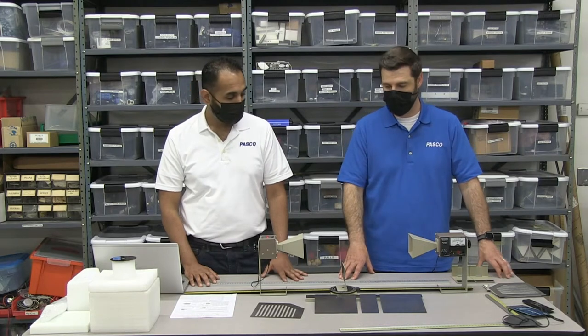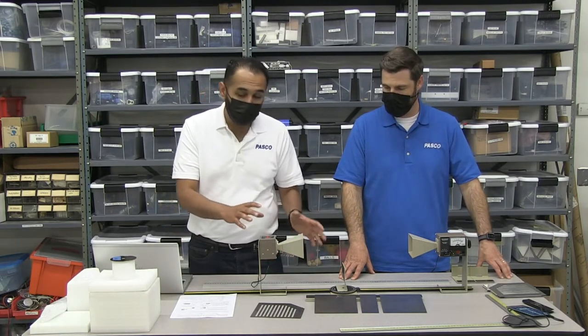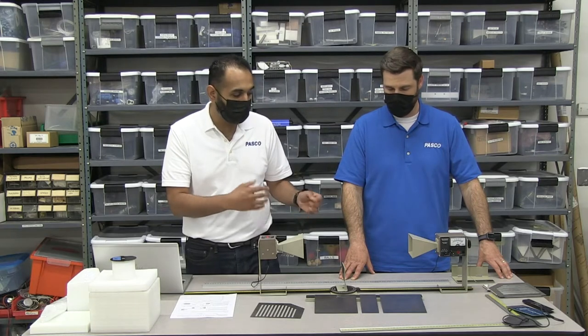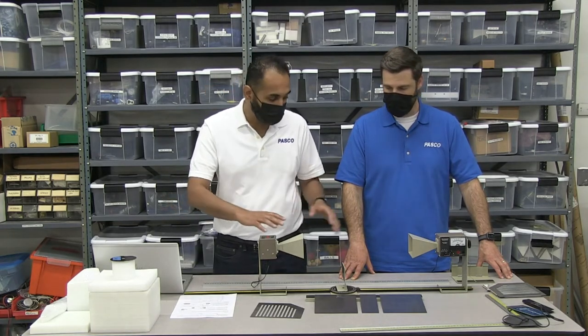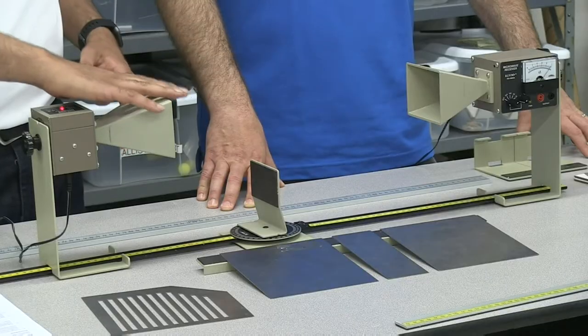We're creating them here and receiving them here, and the polarization plane that they lie in sits in the same plane that the diode itself sits in. What's very important is that in order to get the correct reading — the full strength of the wave — these need to be oriented at the same angle.